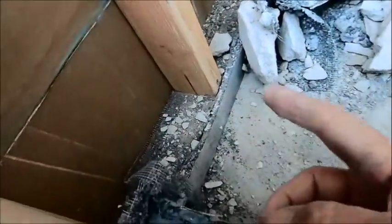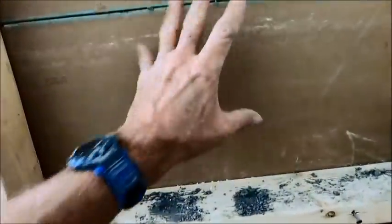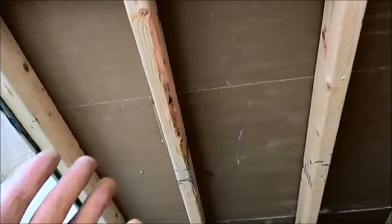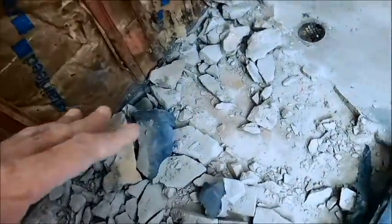There was no scabbing because there was no pan liner used. They embedded their wall board literally into the pan, which if they'd had a problem would have rotted all that wood and the curb. There were so many mess-ups, including this wall they built. The niche was literally not even - it's like they built the niche and stuck it in there using only two-by-fours to hold it. There's no two-by-four in this wall that goes top to bottom because they split the whole wall in half.